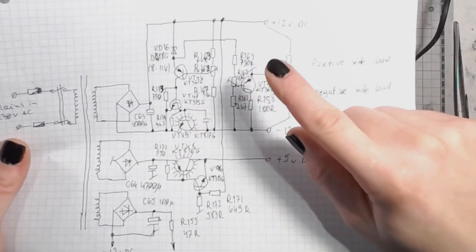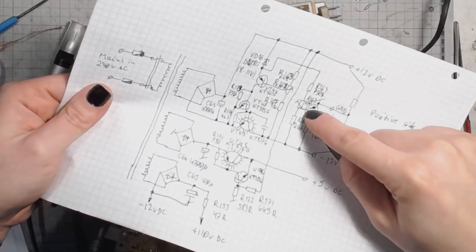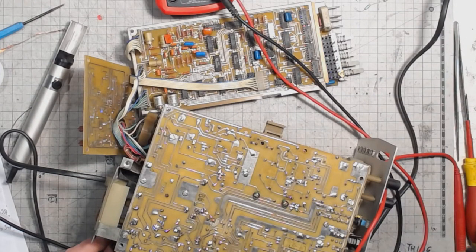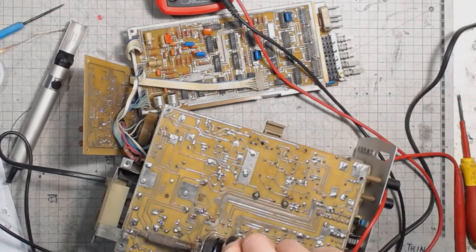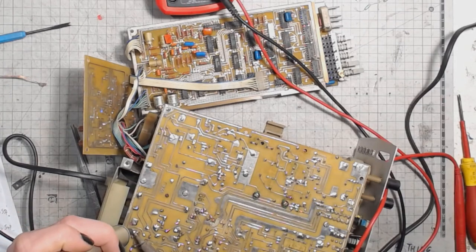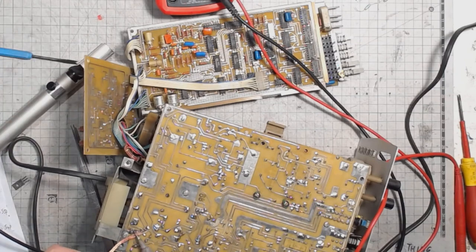I just... see what I did. BD135 is an NPN transistor, and I was supposed to use a PNP transistor here. Got it wrong. Got it corrected. It's a lot of adventures for a single scope like this. But it's a lot of fun. Let's get a 140.